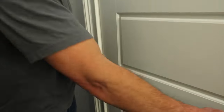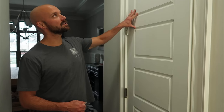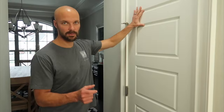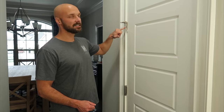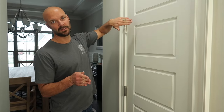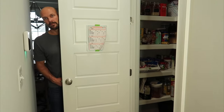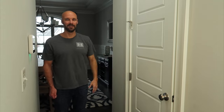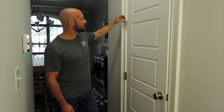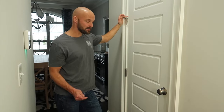This is a ten-foot door, and now the door will almost close itself. Because of the height of this door, if you want it to actually close and latch all the way, I'll likely need to add a second hinge to give it enough force to close completely. What I really wanted was for it not to just sit wide open. I'm okay with it getting at least partially closed, but I might add a second hinge here so the door closes all the way and actually latches.